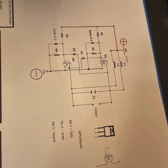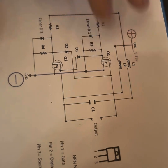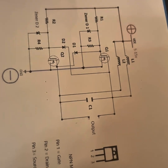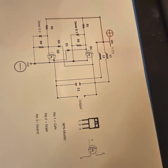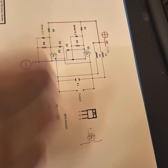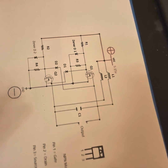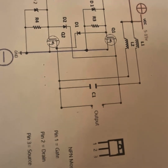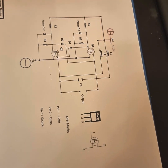What happens in this circuit is these two MOSFETs are constantly turning on and off. When Q1 is on, Q2 is off, and vice versa. The charges are pulled back and forth into the resonant circuit. This is a self-resonant circuit — meaning whatever we put on the output self-resonates with the whole circuit, and that's the magic of it.